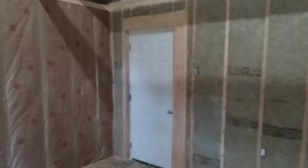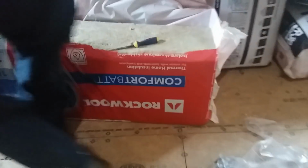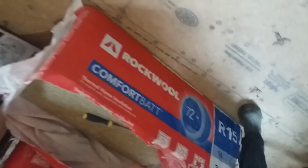So today was install of this rock wool. All right, can you lift that up real quick? Show y'all this. It's called rock wool. All right, pretty good stuff. Has some pretty good properties to it. We thought we'd give it a try. We put R13 on all these walls, east, north, west wall. But on the south wall, this is butted up against an existing structure.